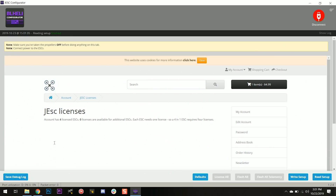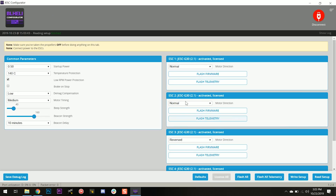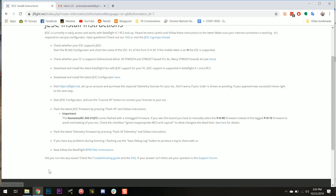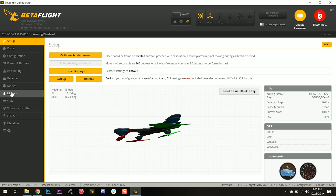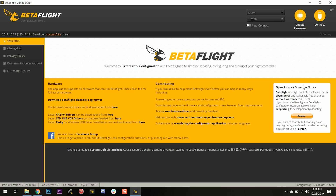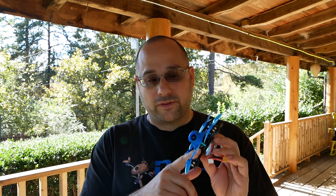We're going to hit Activate ESCs. After the flash finishes, all the ESCs will show activated and licensed. Then the next thing to do is flash telemetry to all of them. Now that's done — the ESCs should be ready to go. Joe included a custom startup tone. We'll enable bi-directional D-shot, go to the motors tab, plug in a battery, and we should see the error percent go to zero. It's not working — bi-directional D-shot isn't going to work on this one today. I got through all the steps but anytime I enable RPM telemetry, the ESC just doesn't see the signal. I don't know if that's an issue with the flight controller or the ESC, but that'll have to be a topic for another day.